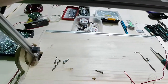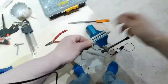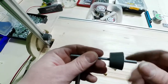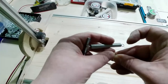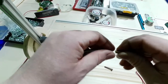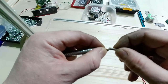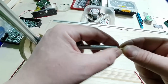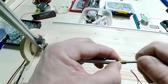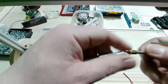Then I'm going, this needs to be filed a little bit. Once again here. Okay, the system will work this way. Here I have the other hand here. It did not get through, now it gets through, and the tensioner will be completed with the nichrome in there, and then the screw, the nut, the bolt in there, okay? And this will be tensioned a little bit there.